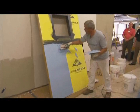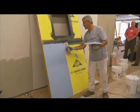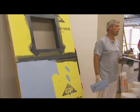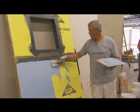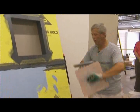As far as labor goes, in our market the contractors have figured out that there's about a 40% labor savings by just using the texture alone and troweling the material. That's pretty much across the board what a lot of firms do. If some firms have less skilled labor, then they will use the smooth and have somebody hand them a paint roller. Otherwise, you just coat it and move on.